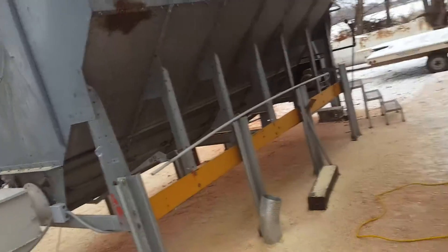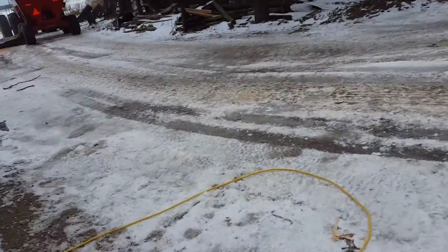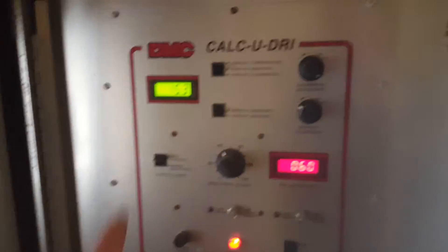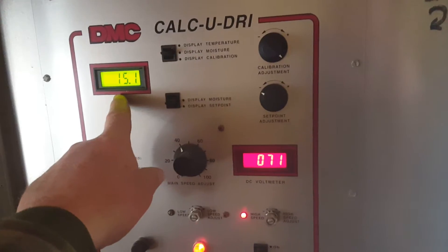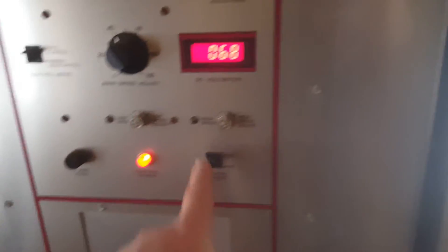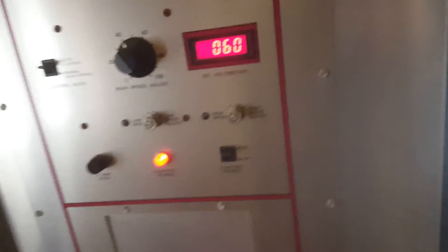It's kind of a nice system compared to what we used to have that did a semi in a day, it seemed like. Then we come into our little shack. We've still got to finish the shack yet, but this is the control box for the dryer. It's sensing the out moisture — remember the moisture sensor out there? It's reading that, and that's just a relative speed of unloading. It's bouncing between high speed and low speed right now, that 60 to 70 jump.